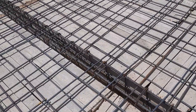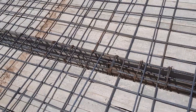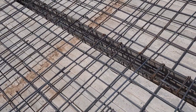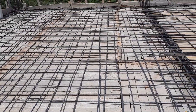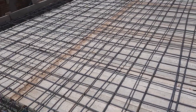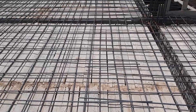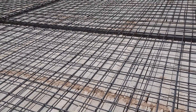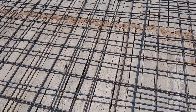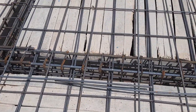Unfortunately, they did a lot of mistakes in the construction of this beam. Anywhere you look, you will find mistakes — especially with lapping length, spacing of stirrups, hooks bent at 90 degrees, no crank bar used, and this is a single mesh on top of which they will provide double mesh. You can see the steel reinforcement alignment is also not okay. This was a short video to show you these kinds of big mistakes in the construction of RCC slab, beam, and span between two columns.